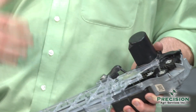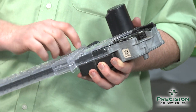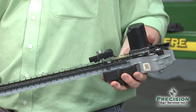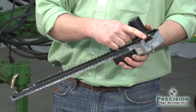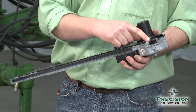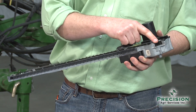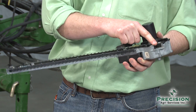I'm going to go through some of the components of the Speed Tube. The first thing I took off is the seed tube sensor that we have on there to read our population. The cover just comes right off. At the top, we have the two feeder wheels that grab the seed. Maintenance-wise, we replace them once a year, just for seed coating purposes — buildup occurs over time, so we replace them to keep the system well maintained.